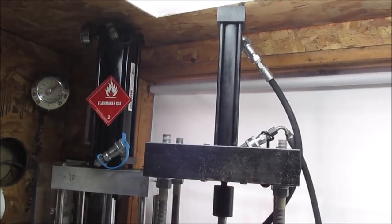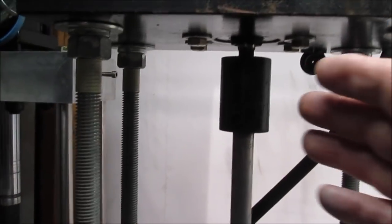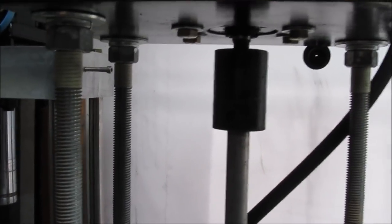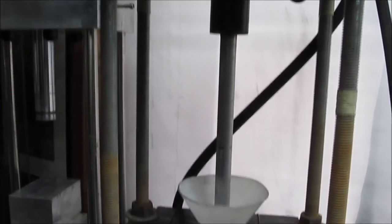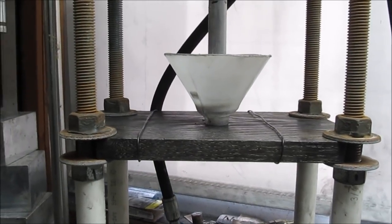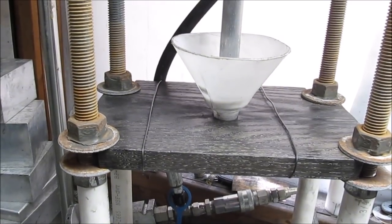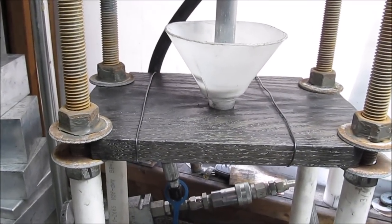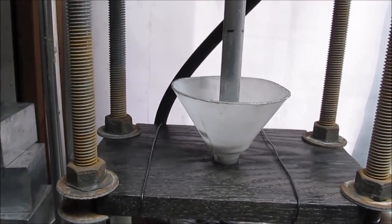It's only a one-inch cylinder on it. It comes down. I've got an adapter on the end of the pressing rod coming out of the cylinder — that's a three-quarter-inch aluminum rod attached to that. That goes down through a funnel. I'll put a sketch in of this whole funnel bridge assembly, but essentially this is a plywood bridge that I've made. It has a hole going through it with a press-through funnel.